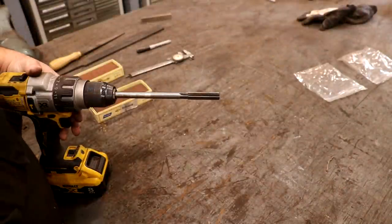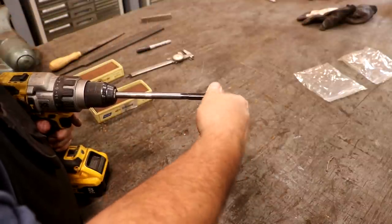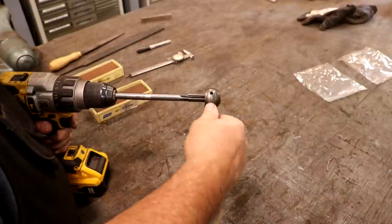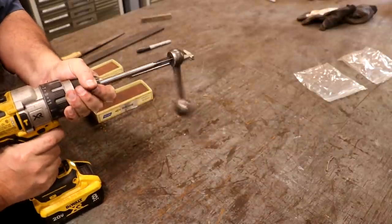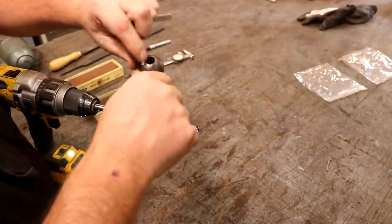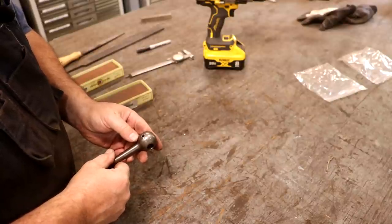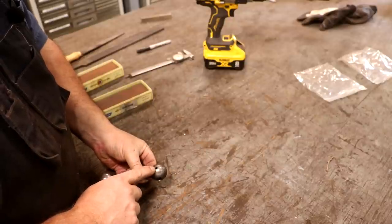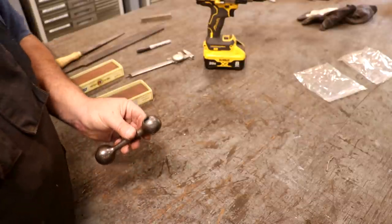I've got a half inch chucking reamer here in my drill. Most of the mushroom is on this side, so I'll come in here and use this side kind of as a guide and hopefully come right out the other side. That should have opened that up — it definitely had a big burr on it. Now let's go over to the mill. First thing I want to do is figure out what size drill the small end of this tapered pin hole is. Then we'll put it on there and see if we get lucky and these holes line up — I doubt we will, but let's see how our luck holds up.